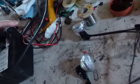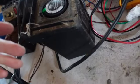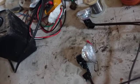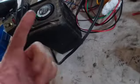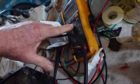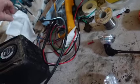You're down the line and in your yard, and this thing's 18 bushes away, and you're checking to see if you got voltage because you got a lights out and you can't get it to come back on again. Just see if the line's rotten or broken or whatever. If you check that line, you better use both AC and DC, just to make sure that you don't get a false negative and go dig up all your line and find out that wasn't it.